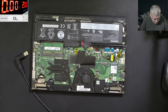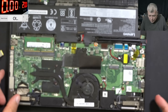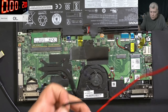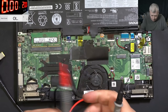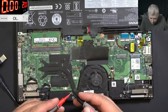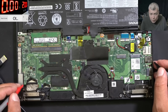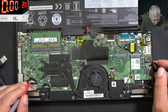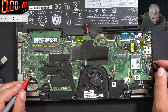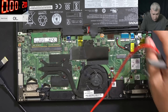The main power rail — where is it? It's annoying when the wires get twisted. So we have the charging port here, we have a fuse — the fuse is fine. Then check here: I can see a first MOSFET, second MOSFET, current sensor — and the current sensor shows zero ohms. Let's go closer and check.